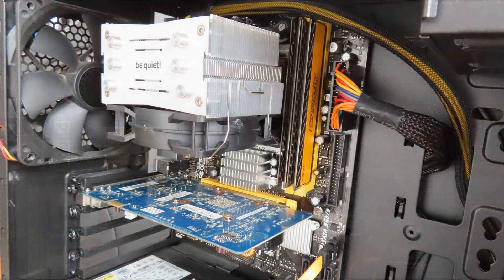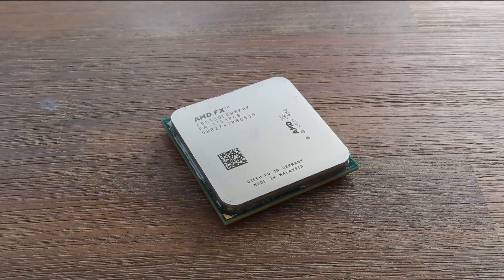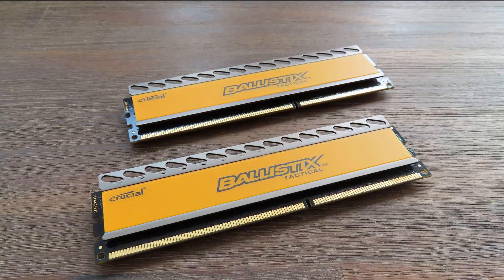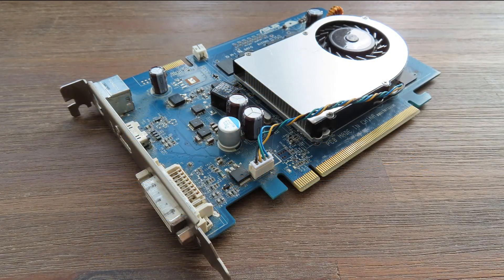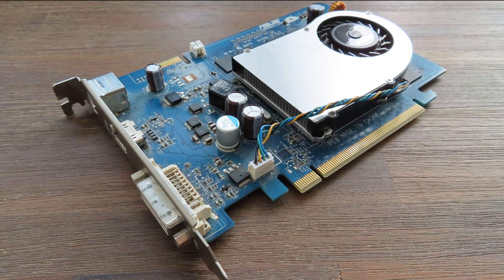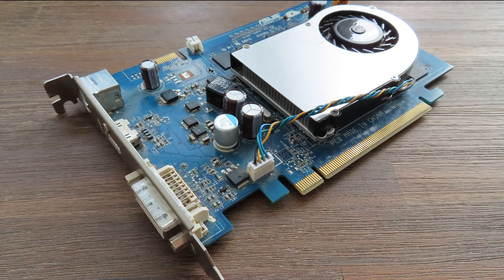To make everything as consistent as possible, I needed a computer with both PCI and PCI Express slots — and that's what this machine has. My regular test bench only has PCI Express, so I couldn't use that one. This test bench consists of an AMD FX-8350, a Biostar A960D, 8GB of DDR3 Corsair Vengeance memory. I also used the only single-slot video card I have — the Asus 8500 GT — because I wanted to create as much EMI within the case as possible, and it creates a lot of noise with its tiny fan.